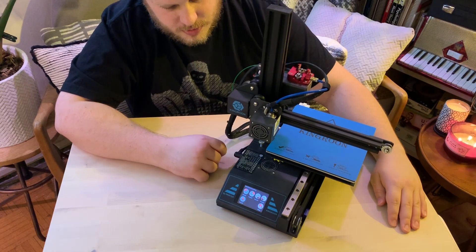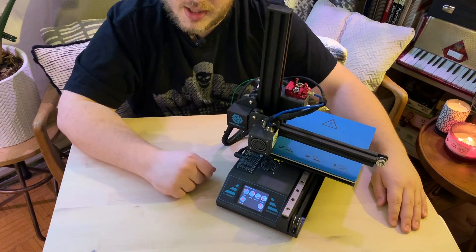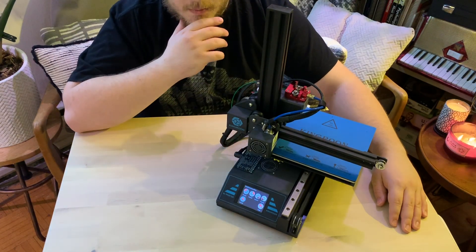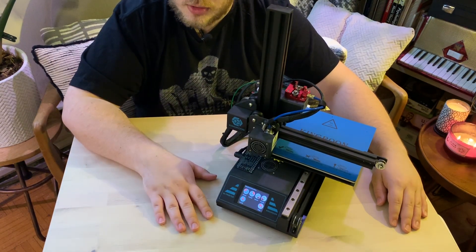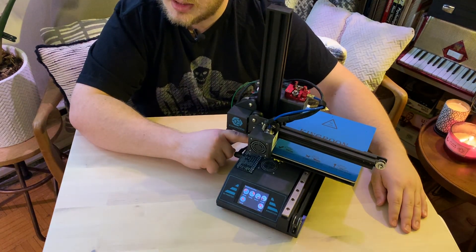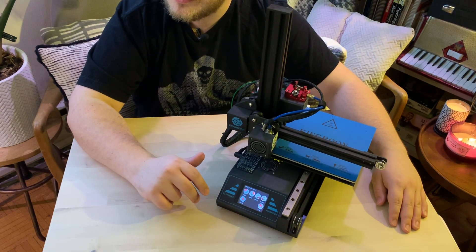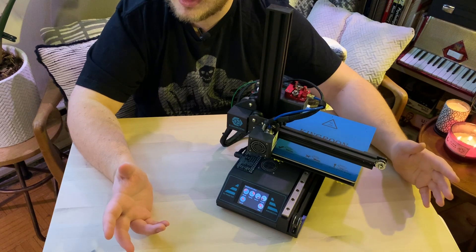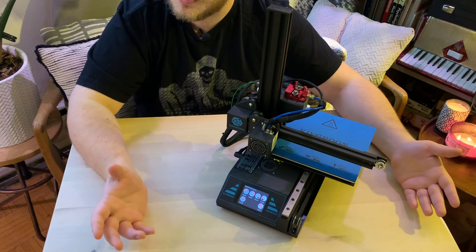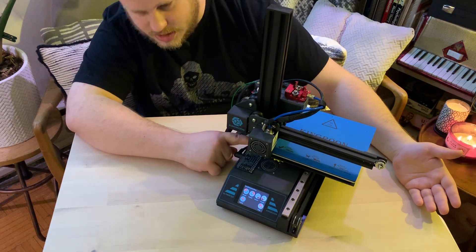What you want to do before you do this, if you plan ahead unlike me, is make sure that the set screw is at the right height. I actually already had it set so in this situation it's fine. What I did to both of my printers is I removed the spring that holds this thumb screw in place. That way it's easier to do finite adjustments and it doesn't bind up on the spring. The spring is good because it reduces backlash, but in this situation you don't have to worry about backlash because the parts should be stationary.